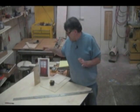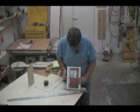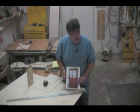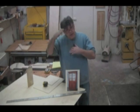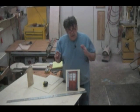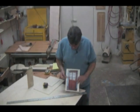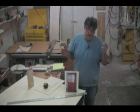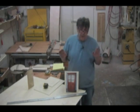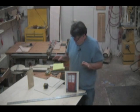In a corner cabinet, because we have a wider piece at the bottom of the door and at the top of the door, we can get a nice deep shelf. But you really don't want to get much less than 9.5 inches in the middle. If you do, you can't get a plate or anything like that in it. That's even pushing it. So 9.5 is kind of the minimum you want there.